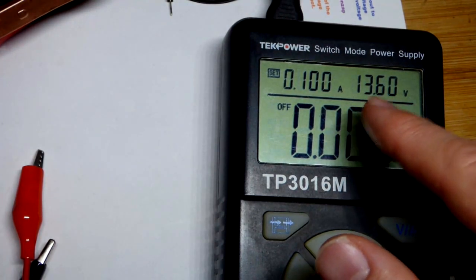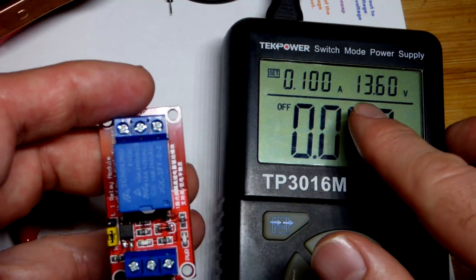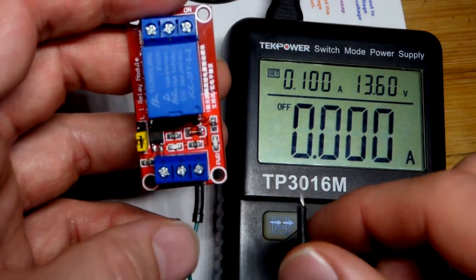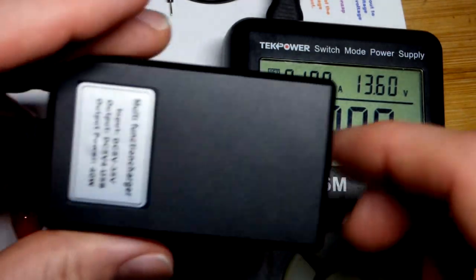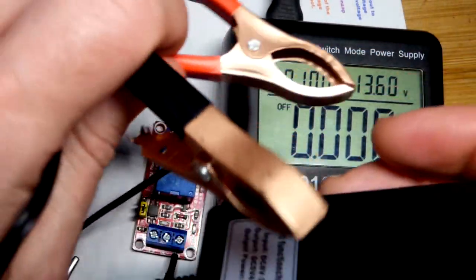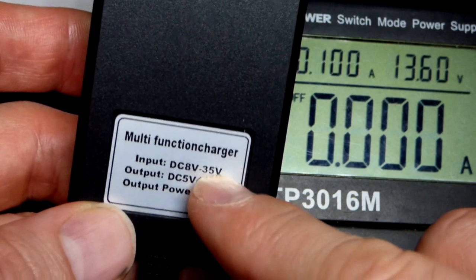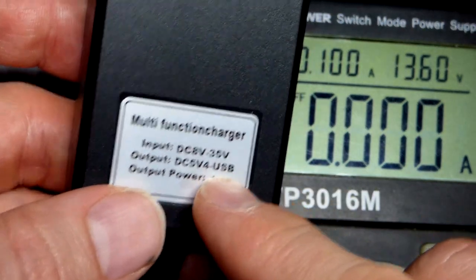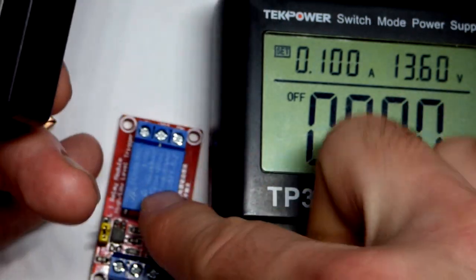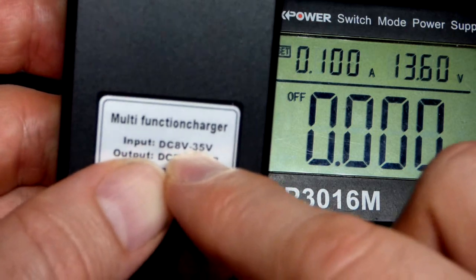We got 13.6 volts. If you fully charge a lithium-iron phosphate battery, they charge at a higher voltage but when you remove the charger and it cuts power, the battery drops right down to probably 13.6 before drifting a bit lower. I want to still power this, but it's a 5-volt module, so we use a simple buck converter. You plug it into a DC source — 13.6 volts works fine, anywhere from 8 to 35 volts. It takes that higher voltage and outputs 5 volts via USB, converting extra voltage into available current.